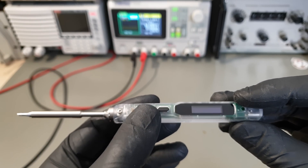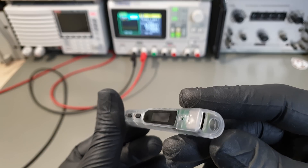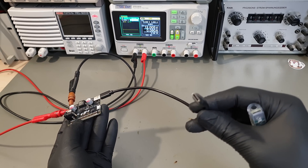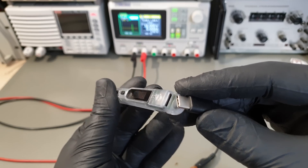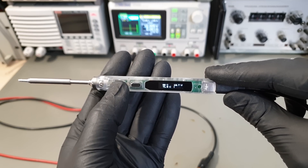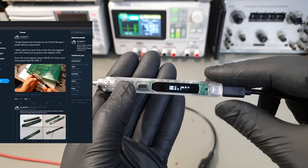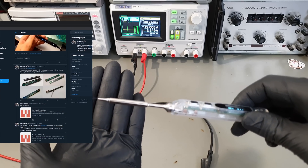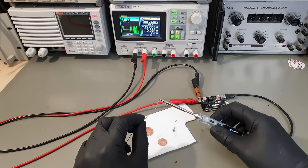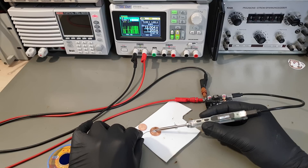Remember this guy — he single-handedly started my Chinese advertising career back in the day. Good old TS100, 65-watt soldering iron powered via DC barrel jack. Except not really — this is a USB-C 60-watt 20-volt power delivery dev kit. Certain laptop or LattePanda Alpha chargers would also be able to do this, but not necessarily TS80-compatible quick charge power banks — those can't source 60 watts, which is what many have criticized about the TS80 when it came out. So to combine the advantages of both irons and incorporate state-of-the-art power delivery, Jan Henrik has designed a drop-in replacement mainboard — open source — and sent it to me. The result is beautiful and much more powerful than a quick charge TS80 can be. The only issue is that availability of 60-watt capable power banks is still pretty limited, but I have a feeling that will change soon.